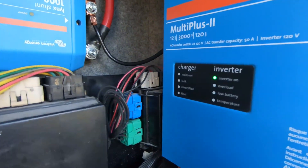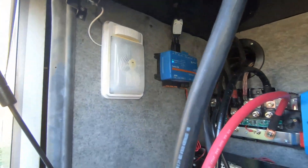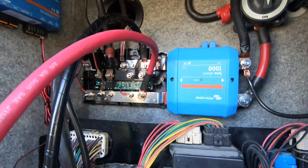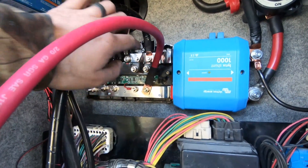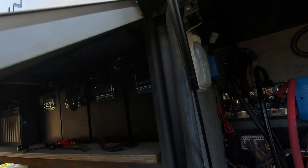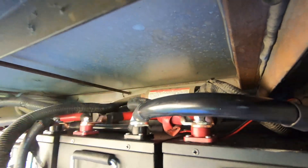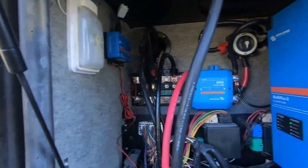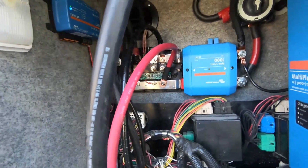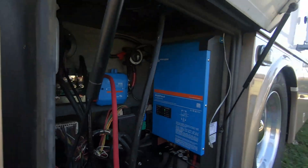This non-professional achieved something — finally have power! Got the inverter on. It's hard to see but the lights on my Cerbo are on, the touchscreen inside is on. I want to point out that I do have a 400-amp fuse right between the batteries and the inverter, so I'm using that for the time being while waiting on the proper one to come in. The manual calls for 400 amps and that's what's in there, so I'm safe.